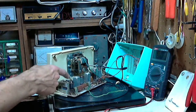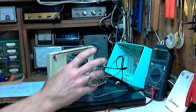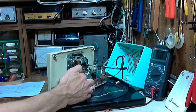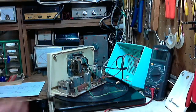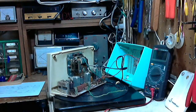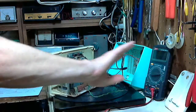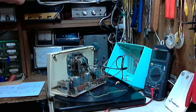Now, these capacitors are prone to injury from people poking stuff in the radio, reaching in with their fingers, not knowing what they're doing. So occasionally you'll find one of the outside plates knocked in. Also, the capacitor can be used to make general tuning adjustments during alignment by bending these plates. But generally, you're bending the outside plate away from the other plates, so it shouldn't introduce a short. But clearly, something is happening.